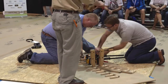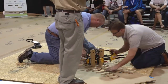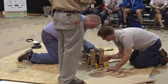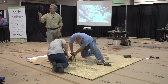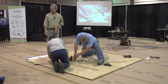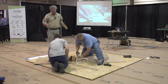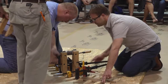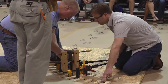So these forms, we're clamping it to both sides, so it will conform to the curved piece we've made perfectly, or at least very well. And then I'll use a router with a trim bit on it and cut the masonite. I like to use masonite because it's consistent. And then that will give us a form with a slot in it. And then we'll use that over the floor and cut the slot.